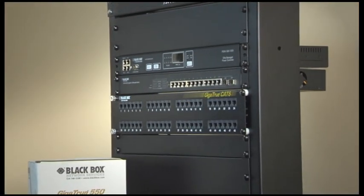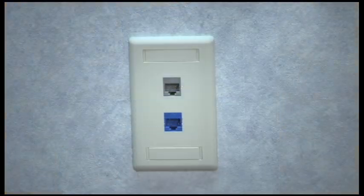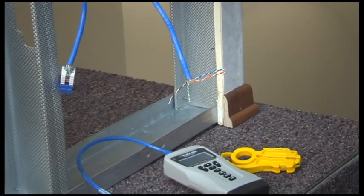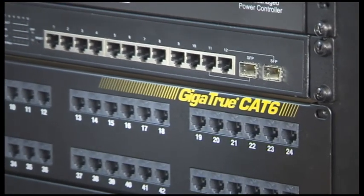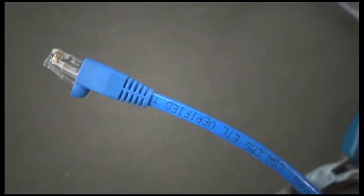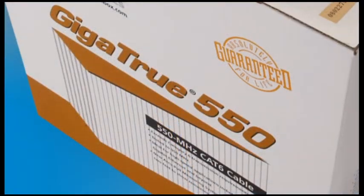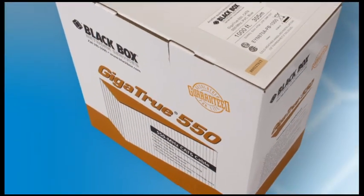Now it's time to validate and verify the permanent link — that is, the connection between the patch panel and the workstation terminal. It's the wiring that's part of the facility, rarely moved once in place. Typically, it's the wiring that runs from the wiring closet patch panel to the workstation; however, it could just as easily run from the wall cabinet to a point of sale device. For clarity, we're going to use this patch panel, solid UTP wire, and a typical wall jack. Solid core is required for use in a 110-style punch-down block.